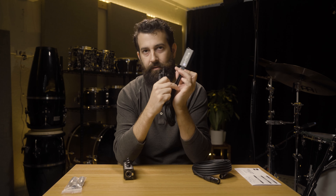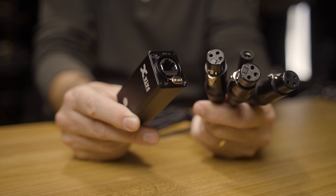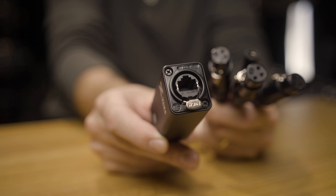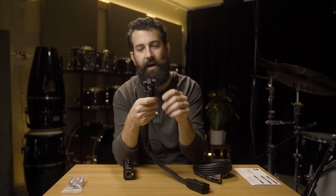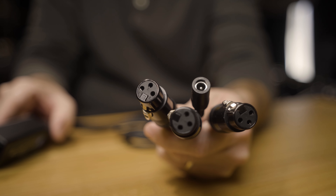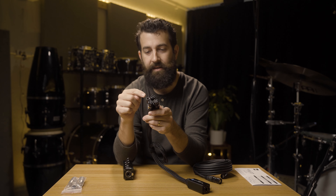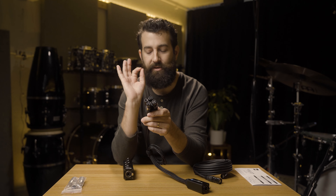This dongle is very cool. First of all, it's braided — awesome, not going to tangle. Second, it's CAT5 and it's barrel locking, which means you plug in the CAT5 cable and it's not going anywhere. You've got three XLR females, and then a little power delivery connection. You can use any sort of one-spot — it's nine volt and it can power the mixer up to 200 feet over power over ethernet, which is really cool.